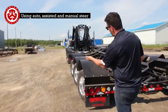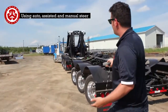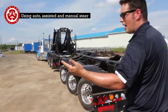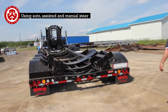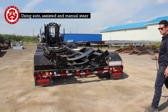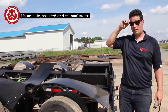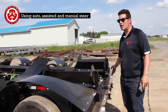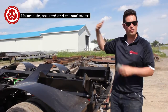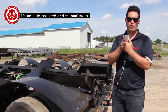So what I can do now, so I can go and steer right over, and now even if this turns in relation to the truck, these axles are going to stay planted where I left them, so I can go walk over, crab walk, do whatever I want on the intersection. And now I'm fine. I want to turn over to the other side. Anytime you do this, the two systems are going to be not timed together anymore. So you have to go line up the front, make sure the arrow is good, then you come back here, have this arrow. Make sure to only have the one switch on so that you pressurize both sides of the system. Right now the two sides are separate, so when you go, you make sure to have it so that it's just the one switch is on, so you pressurize both circuits at the same time.